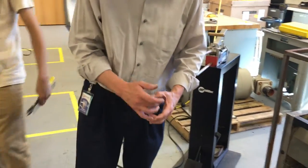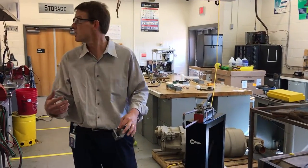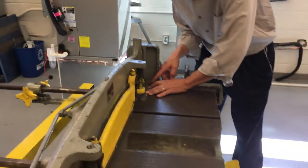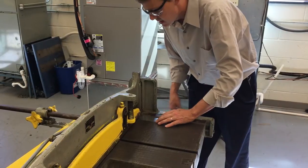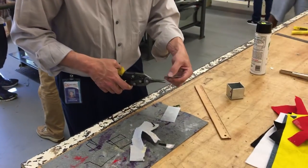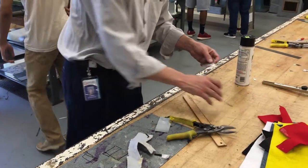What else we have to do is cut a 2-by-2-inch piece. I'm going to put it down in the bottom and then tack that as well, and then it's ready for the felt. I'm going to line it up at 2 inches on the shear and just shear it off — actually, I'm going to take a little bit more than 2 inches off, maybe like an eighth on one side, and then make sure that we're at about 1 and 7/8ths on the other side. Then I'm going to trim the corners a little bit with a pair of snips — just trim those corners right there a little bit, little notches. Now we're going to tack weld it. It should fit in the bottom like that, and now we're going to tack weld it together in the bottom.